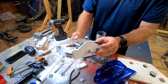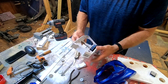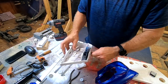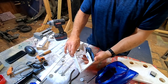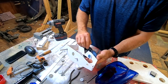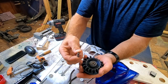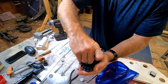This is going to clean up everything, it's going to be awesome. Got C-clips everywhere. All right, take out your shaft — and don't forget the orientation of your gears. I'm glad I did take it out, because look at that — that bearing is destroyed.